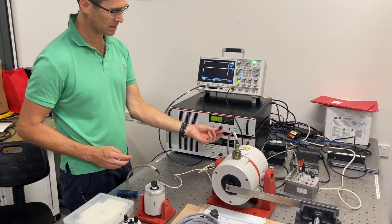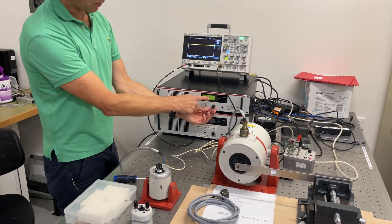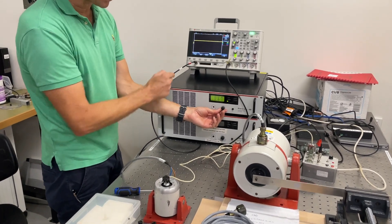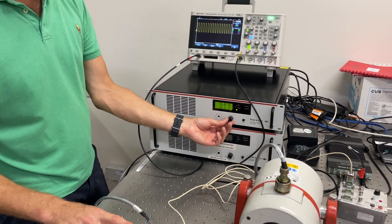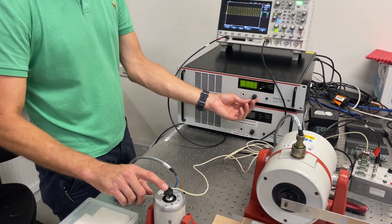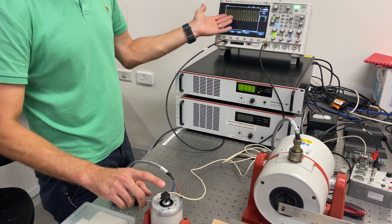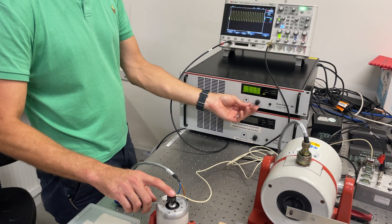It clicks initially, and that's now at zero amps and zero volts still. There's an input signal of half a volt turned on, and as I slowly increase the gain, I start to see some signals. The shaker's now making a sinusoidal signal, and you can see that measurement on the oscilloscope — I can feel it with my finger.